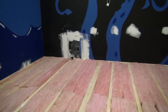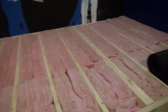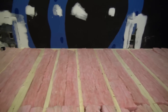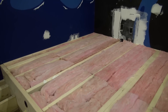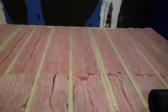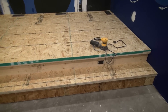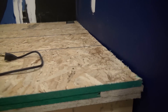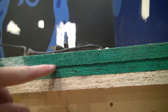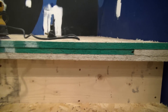That should give a nice solid base and there shouldn't be any echoing. The reason we put the pink insulation in here is that this will become a bass trap — I'm going to put vents in the corners and along the back, which will give me a chance to absorb some of those annoying bass sounds. The riser is done except for the carpet. You can see three layers: three-quarters, five-eighths, three-quarters.